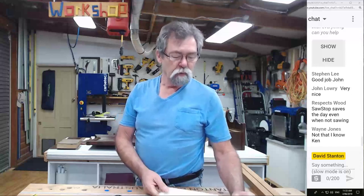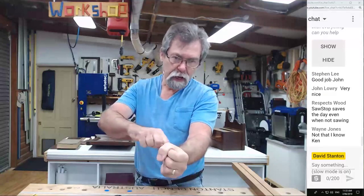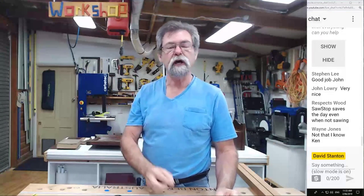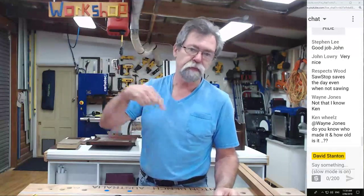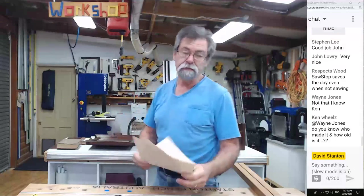I'll tell you what, I worked with a guy who was using a router and it caught and the router went up his arm and opened him up right the way. And he said all he saw, it happened so fast, all he saw was a pink mist in front of him. That was his blood. They're so dangerous. So if you're using a router, please only take, well, on the CNC machine, I never take it past 6 millimeters in one pass. When I'm using a hand router, I try and restrict it down to 3 millimeters in a pass, maximum. Any deeper than that, you get a slight twitch, that cutter is going to go straight into the wall and grab and throw the machine out. So there you go.